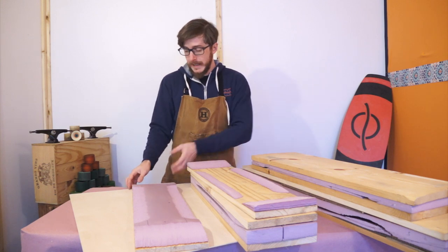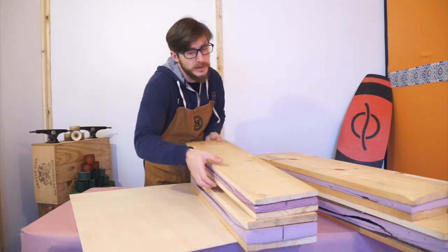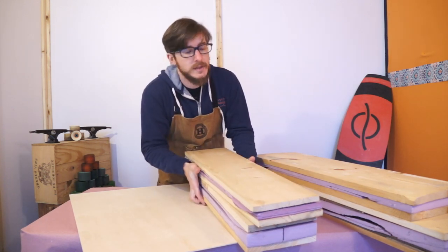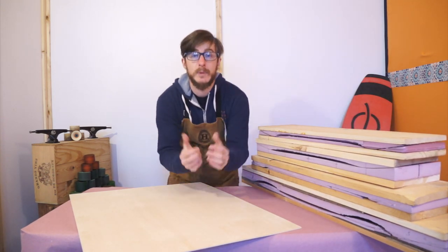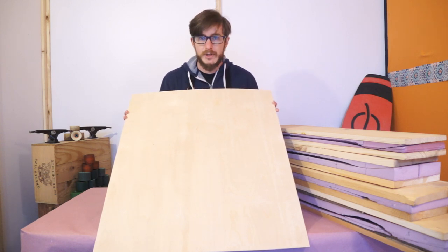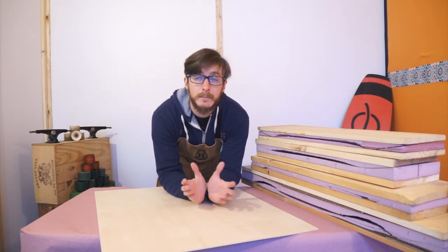The other drawback is that because of the tolerances in a mold like this, at least the way we're going to be making it, there's very often a little bit of a gap between the male and female halves. What that means is that we have to use a slightly stiffer material. So instead of using Canadian maple or rock maple plies, what we're going to be using is Baltic birch plywood. It also goes by Russian birch, aircraft grade birch, marine birch — all different terms for a high quality birch plywood.